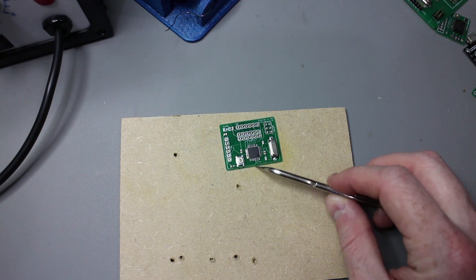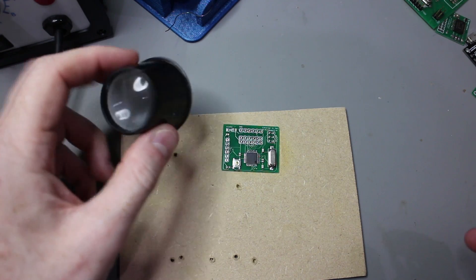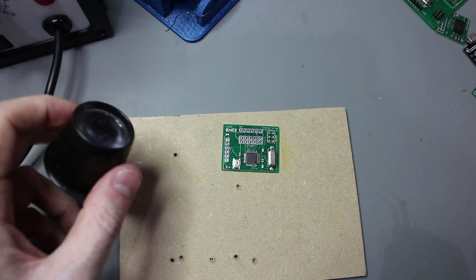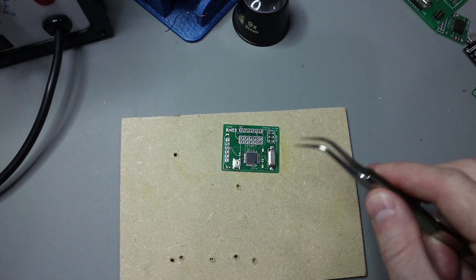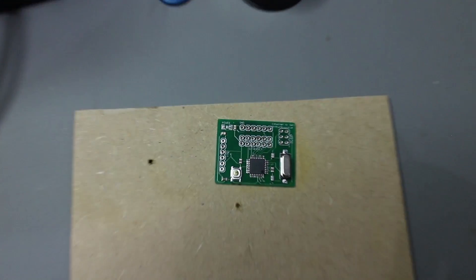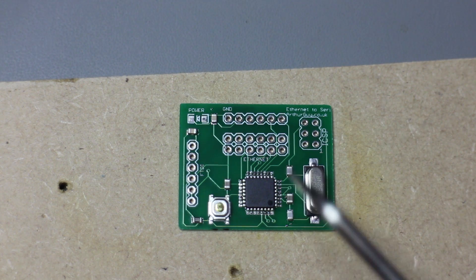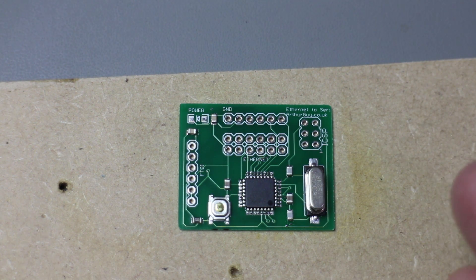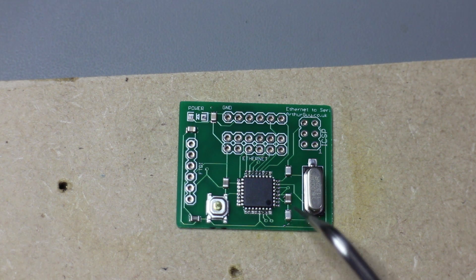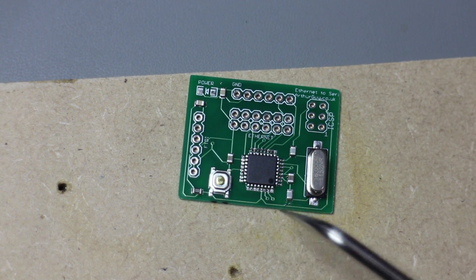At this stage the board is obviously very hot, so don't pick it up. Then it's a case of inspecting the board to see if there are any problems. A little magnifier is invaluable for checking over boards - it really does give you the magnification you need to see what's going on. Luckily this time around, despite a particularly messy application, it's all worked quite nicely. The chip has gone in really nicely, and on some pads where I put down a little bit too much paste, any excess solder has just been pushed out to the sides in little balls and brushes away.